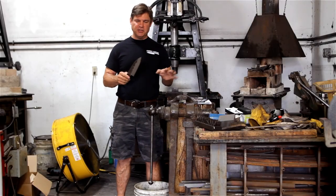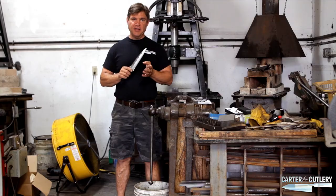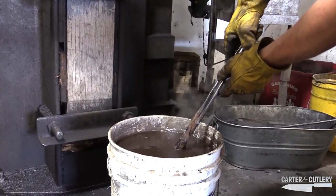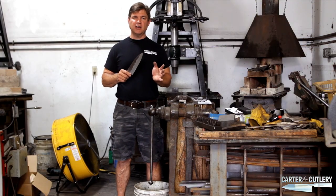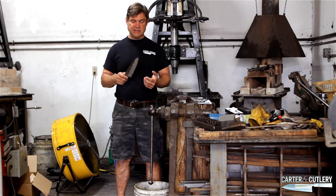The reason why we're able to do that is because the secondary edge of this blade is really, really thin, and the primary edge is sharp and very acute. This is a hand-forged water quench, Japanese laminated blade. It's got a white steel core, which is roughly 1.4% carbon forged and water quenched, resulting around Rockwell 64 as tempered.